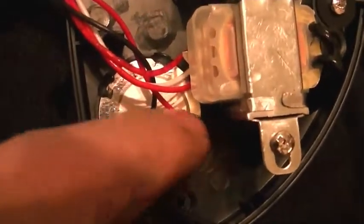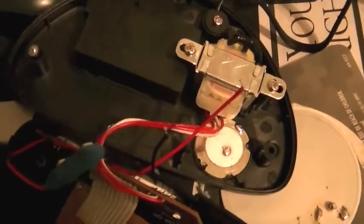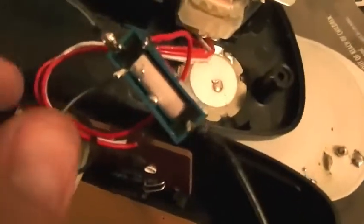That should be right here. You need these two wires. Unsolder the wires from the speaker. Now with the wires removed, solder the wires that we just unsoldered from the speaker to our reed relay — these two little terminals right there. Make sure they're soldered on nice and tight.